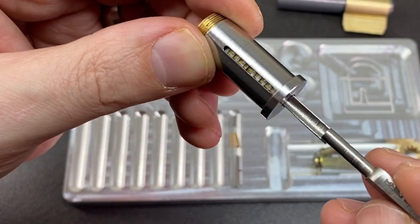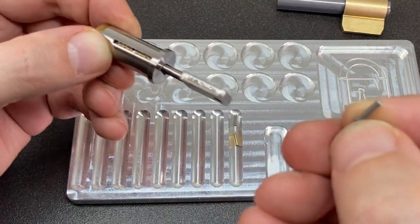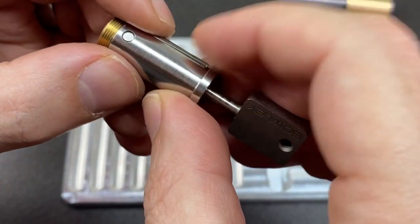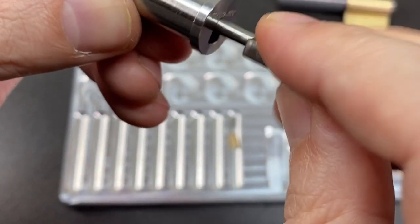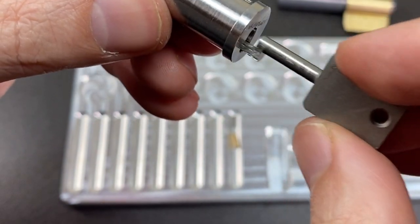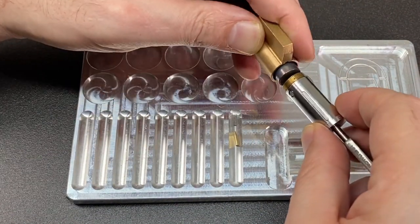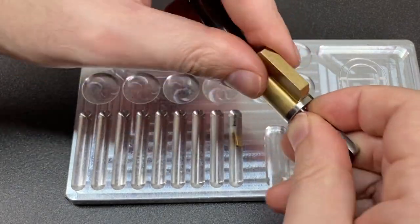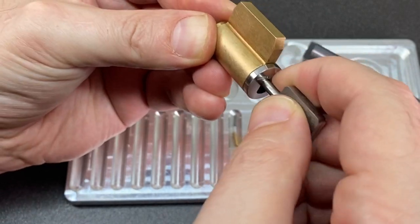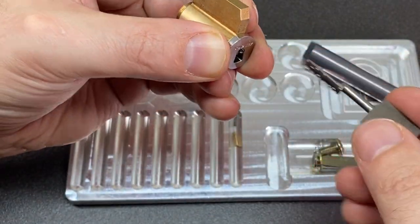All neutral — pop the key in, rotate — it should just jump in now. That's perfect. To test it: make sure that ramp there is facing to the left. The key isn't turned so it's sticking out — push the key in, rotate it all the way back out, start again, put it in and it goes flat. Remove it, it jumps up; turn it around, remove it, put it back in, it jumps down and it's closed again. So we know that is now perfect. Push this into the keyway and it should rotate round freely as if it was open. Pinch the back, rotate that out — the sidebar's now popped up. We can still pull it out but it won't rotate round, then move the key round and remove it. So we know that's working.